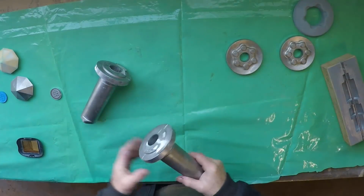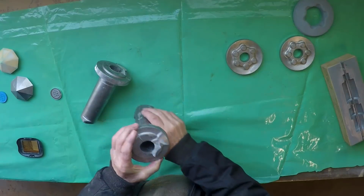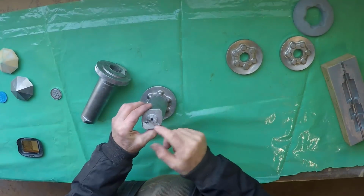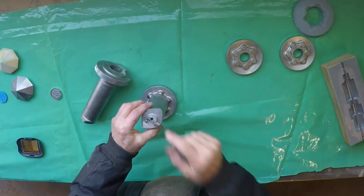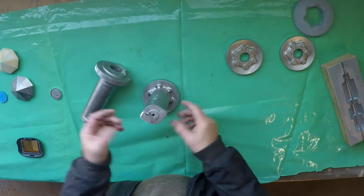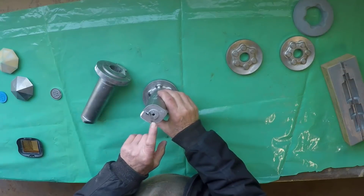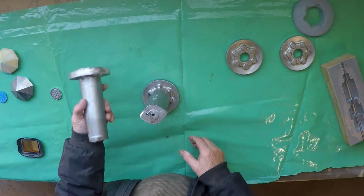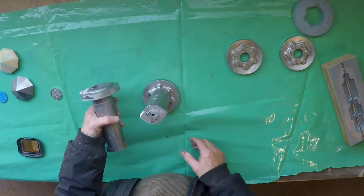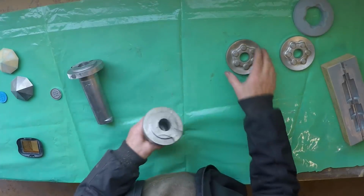Well, the end of the job. The risers, feeders, gates, etc. have now been cut off. The core's been removed. Even the steel brass tube that was down the middle came out. The metal didn't attack it, mainly I think because I painted it with a boron nitride wash, which repels the metal. So we have his 2, and I guess his aged old Maserati will soon be back in business.